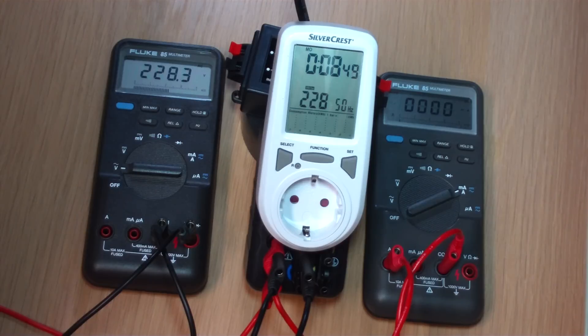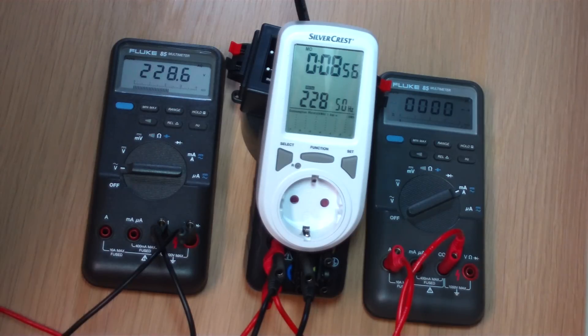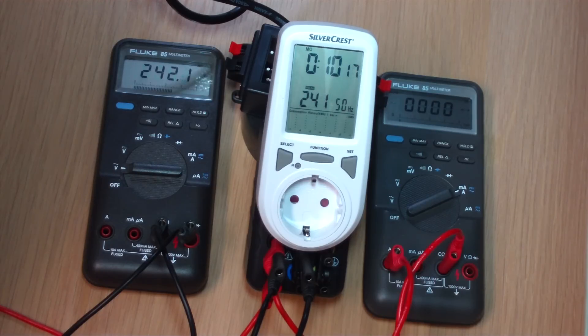It is doing well. I am going to try to put it on my Variac and just lower the voltage a bit and see if I can go down to 200 or something. Let's put it on the Variac now. I put it on 241 volts and it is measuring the same. Let's drop to 230 and see if it is still measuring the same thing. Yes, it does. So it is pretty accurate.